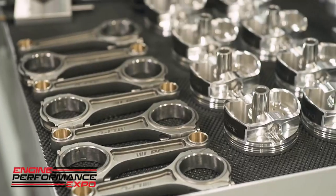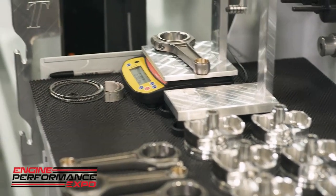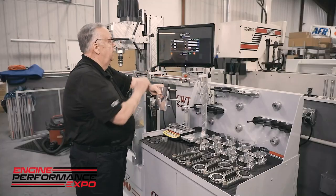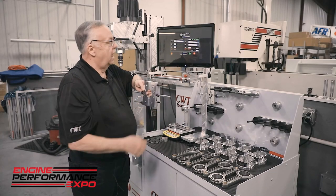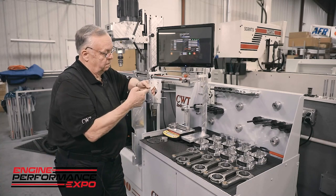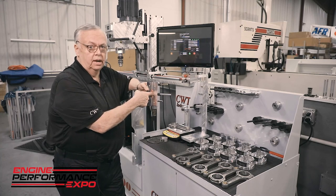As we build this bob weight card, we're going to then turn around and put shim weights onto the unit that equals the bob weight card. Once again, I'll go back. This particular one is 1810, or each half would be 905. That 905 is per half, so that means the moment center line is the right dead center. We call it the principal center line or moment center line.